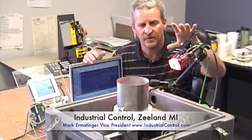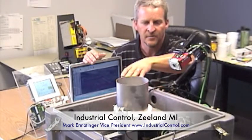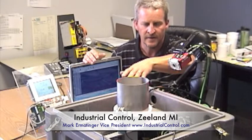I have a QXHawk from Microscan, which is a 1D linear barcode reader and a 2D barcode reader. It's not a vision system — it's purely just a barcode reader. This QXHawk is really designed to read direct part markings, DPMs, which is basically a two-dimensional barcode etched right on the can. You can do it with a laser mark, dot peen, or chemical etch. In this case I have a 2D dot peen mark on here.